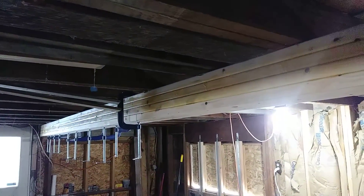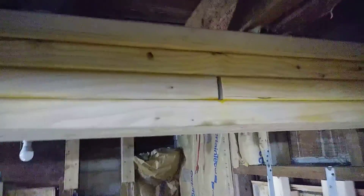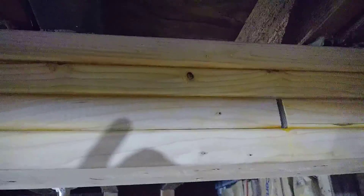This beam was built by adding four layers of 2x6 beams. These beams are not the full length of the span, so you will see joints occurring in the beam. We started by attaching the top layer — a full-length beam — glued and screwed to the existing floor joists. After that was in place, we used it as a guide to attach the subsequent laminated beams. With each successive layer, joints were added and the joints don't line up. This is key — it spreads the joints across the entire beam, making it behave as though it were a single-piece beam.